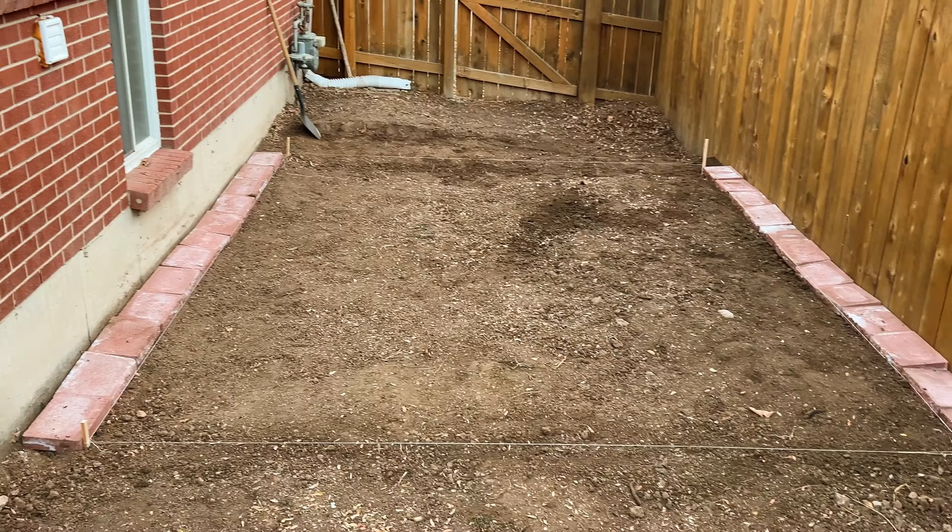Almost there — and here's the block and shim graveyard. I got it all the way over here. As you can see, this side has to come down a little bit, so I just need to do a little digging. I'm going to put blocks all the way around and underneath it to give it a nice solid floor. About two hours later, I've got pretty much the whole perimeter blocked off and level — rechecked it one last time to make sure nothing moves and there are no gaps. Next is to replace the floor. On each piece I put a little number mark so I know what pieces go where.